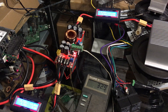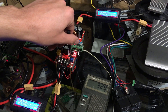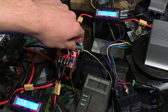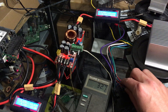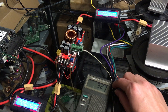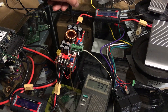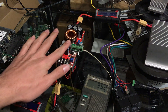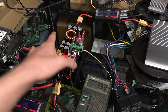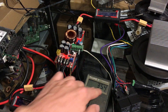It still powers up so the MOSFET isn't fried. It must have possibly been when I was bumping the potentiometer and it went up too high. All right, we're back to 31.6 volts. 183 — 285. So that's 30 amps on the input, 9 amps at 32 volts out — and it turned off again. Hmm. Oh, this heat temp is a little warm; the fan is not spinning. 36 degrees on there.